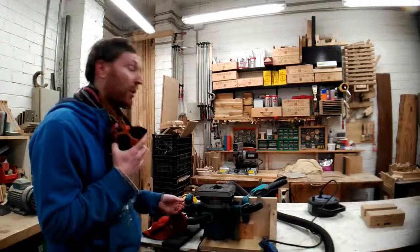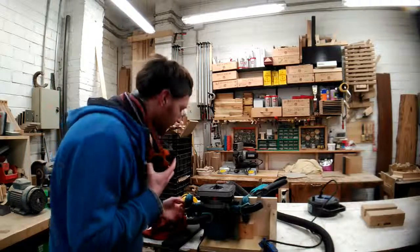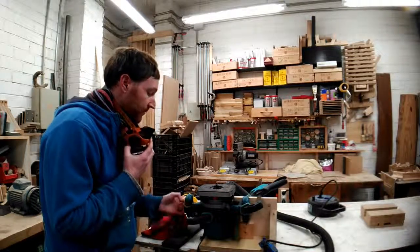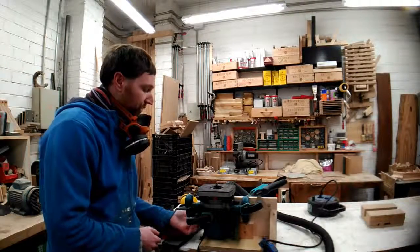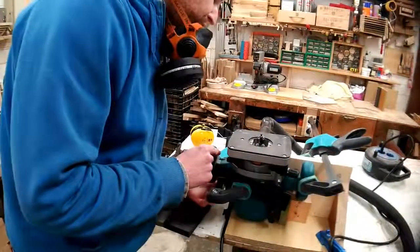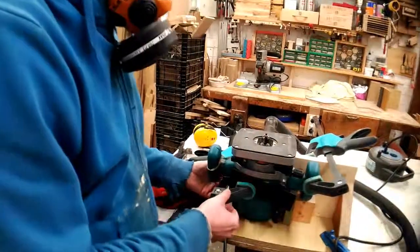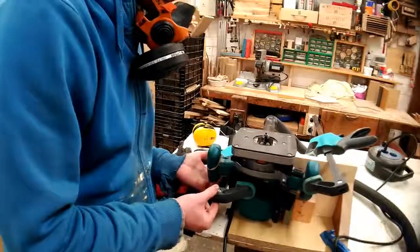Incidentally, overcoming this principal safety feature of the tool goes against the grain to do this. I'm actually a fairly safety conscious person in general. Standard way of getting around it: your inner switch here, on the inside edge, the little round one, is just almost in contact with the speed clamp I've installed here, because I've no space to set it further in. It's actually touching the body. You've just enough space to get your finger in there.